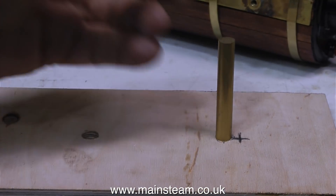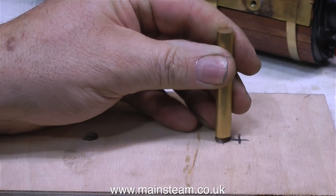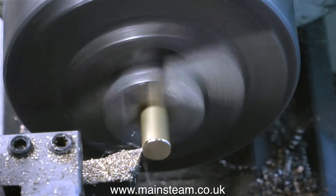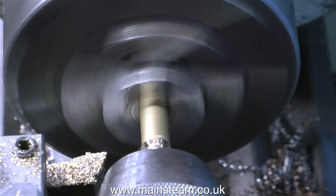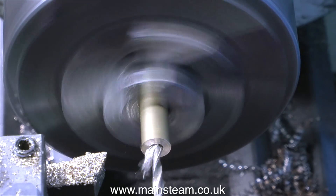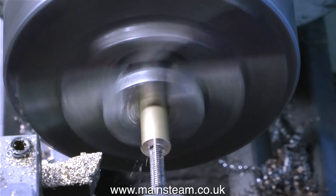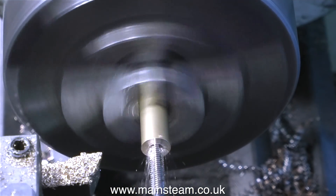Now it's time to remove the boiler and make a proper fitting to mount the burner in the right position. In exactly the same way as I did with the boiler mountings, I counter-bored the hole using the same depth stop and a 3/8th of an inch drill, because this is a piece of 3/8th of an inch diameter brass bar. Now it's over to the lathe to start the machining operation — same procedure as normal: face across the front first, then drill it with a centre drill. For this job I'm using a 5/32nd of an inch twist drill, which is tapping size for 2BA, because the bottom part that sits into the baseboard needs to be threaded 2BA. Now I'm about to use a 2BA tap to thread the hole, doing this under power just because it's quicker. Whenever I reverse the direction of the lathe to withdraw a tap from a piece of work, I always keep my hand on the tailstock chuck, to keep the chuck tight on the tap and also to take some of the weight of the tailstock.